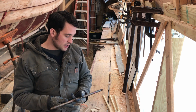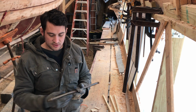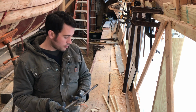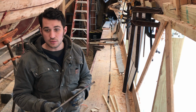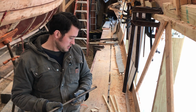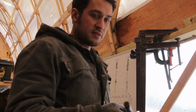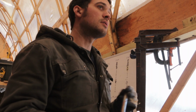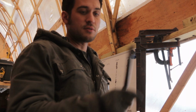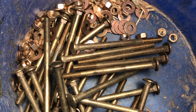The only way that a bolt is really going to commonly fail against extraction is that the wood is actually going to split and fall apart, which, one could argue, is not the fastener's fault. Anyway, because they're really quite substantial and they go through the whole piece, they are one of the better things against shear loading as well.